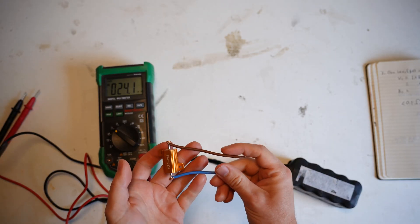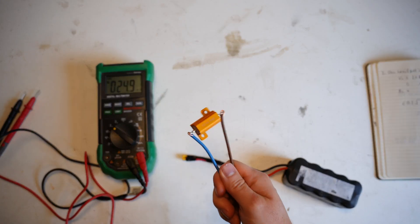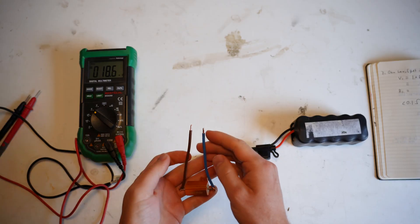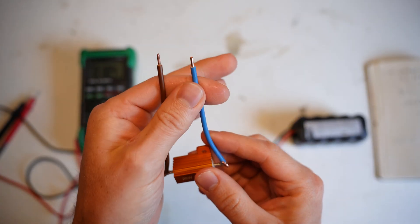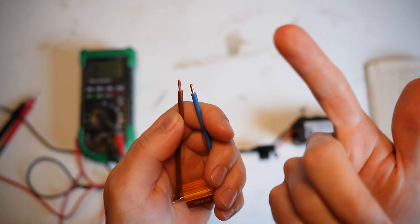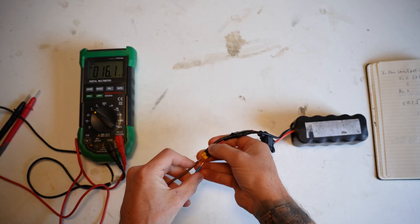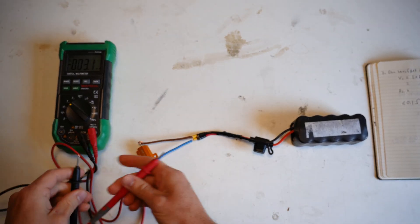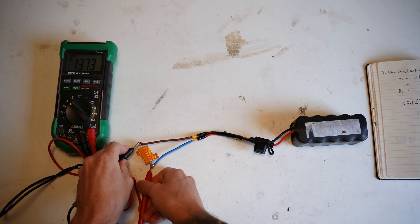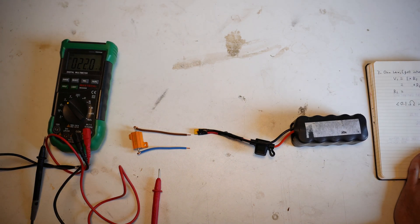Then, using a resistor — you don't want to keep this on load for too long because this resistor is going to get hot, as we're going to run about one amp through our system to get our known load. I've just taken a couple of 2.5mm copper wires used for standard household electrical and wired them up to the resistor, and then we can just plug these straight into the battery terminals. Now, thankfully this is fused, so you shouldn't be getting anything dangerous here. We're going to load these in. Now they've got a good contact — we're going to go ahead and measure. My loaded voltage is 13.72 volts — we can see we're starting to drop there. So I'm going to call that one at 13.72 volts.